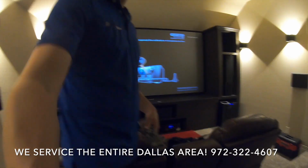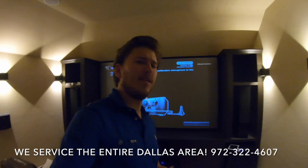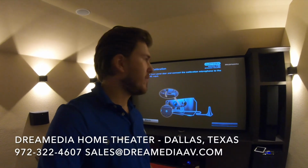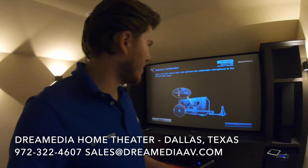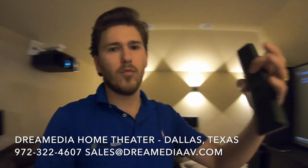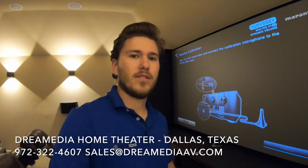Typically what we'll do, we'll run this calibration setup mic as a good starting point, and then we'll come in and get our crossovers just right and run a few demos and just see what the customer thinks, as well as how the system's responding, and then we'll make an assessment on what needs to be adjusted accordingly.